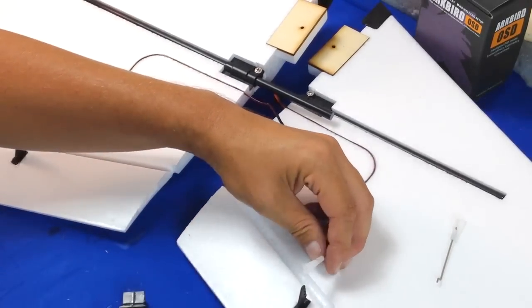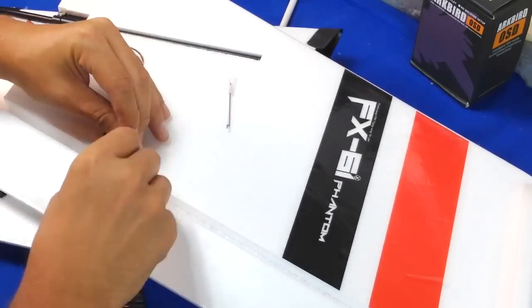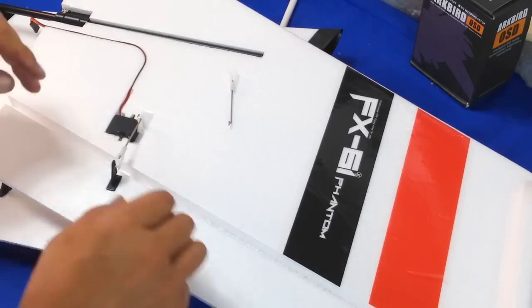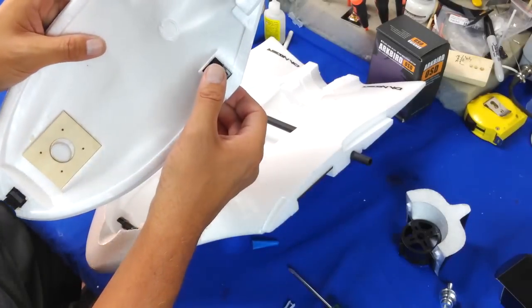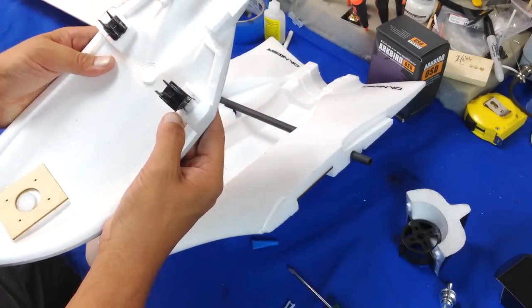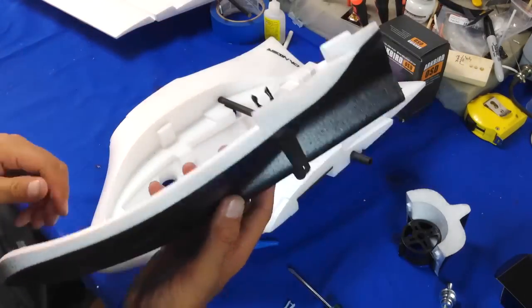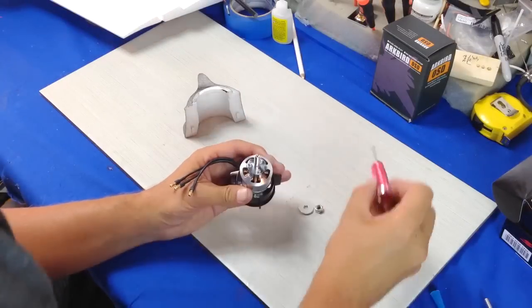At this time I'm installing my control rods. My servos are centered and I'm lining up the edge of the foam at the end — basically getting it as close as I can, so that's a pretty easy step. Here I'm gluing in my snaps for the posterior section of the canopy, tacking it in like I did with everything else in this project using foam tack. After about the third tack it becomes almost impossible to remove.